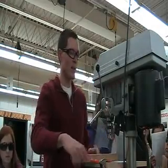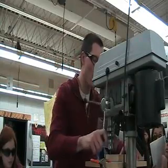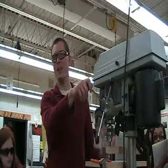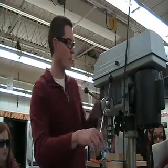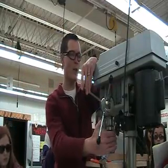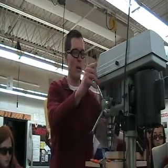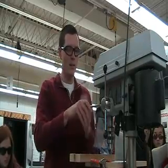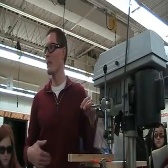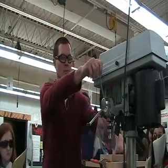Another reason — a bigger reason — is once in a great while when you're drilling into a hole, the board will get caught and stuck on there. Usually it's when the drill is dull. This thing will spin in that direction. It's going to turn the board over here — it just hits that and it stops, nobody gets hurt. If you were off to the right-hand side, especially with a longer board, that's going to be very painful. So there's only one way, and that's to be to the left.